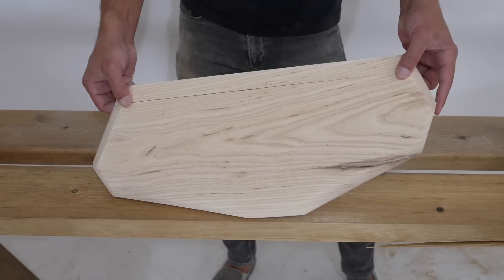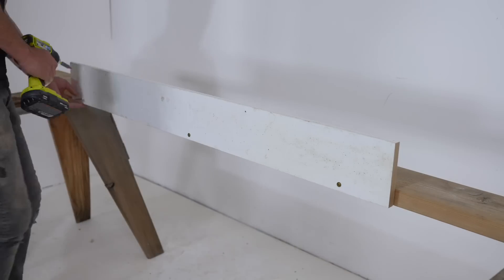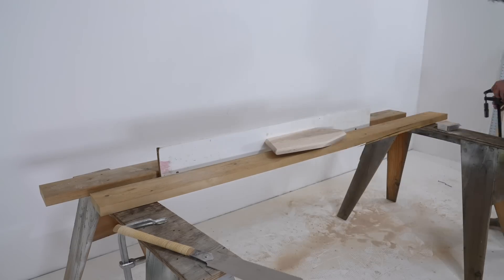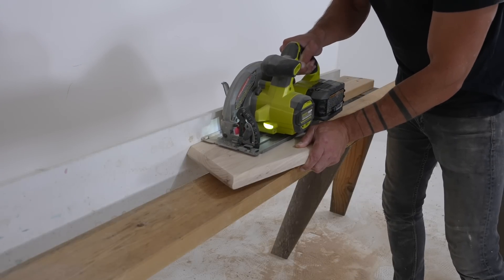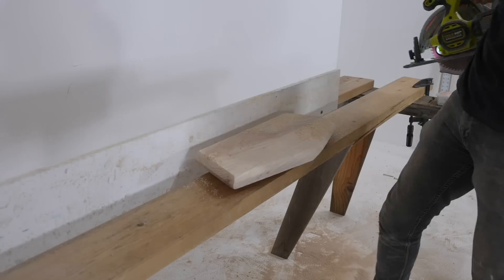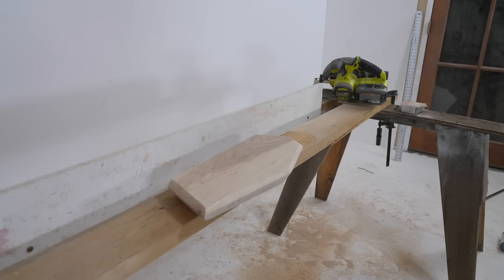It's way faster to set up a jig and use your circular saw to rip the piece in two, but the blade on a circular saw is almost an eighth of an inch wide — that removes a considerable amount of material, and when you line the pieces up the facets aren't perfectly aligned. That's not the end of the world; it just means you have a little more sanding to do after you insert the dowels and put the pieces together.